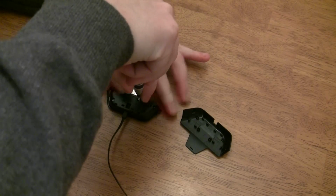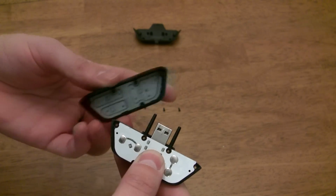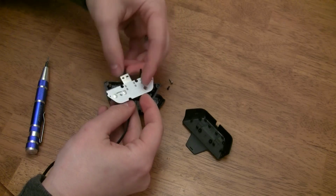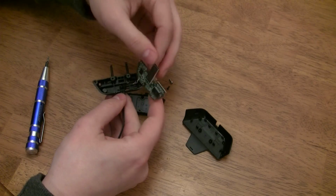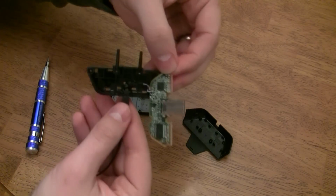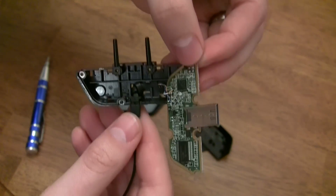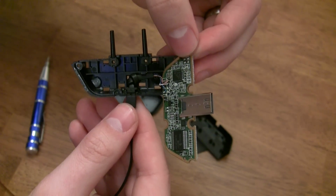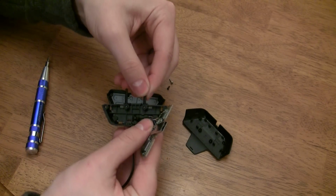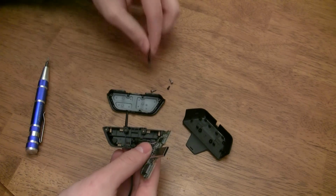Once you get the screws off, the plastic shell will come apart into 2 pieces like this. Take a look at the circuit board. You'll see 4 wires soldered to the board. Those are the mic, speaker, and ground wires. You will be unsoldering these wires and soldering the new wires from your gaming headset chat cable directly to these locations. Also notice that these 2 guide pins come off, so if yours popped off earlier, you can stop panicking now.